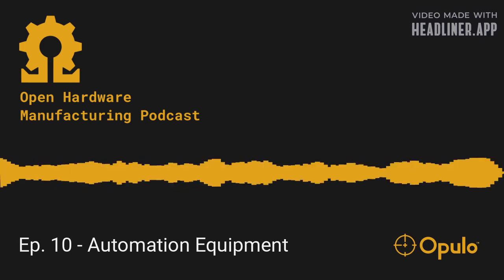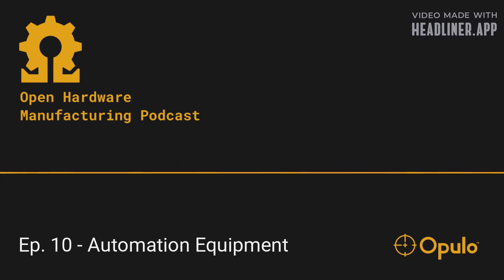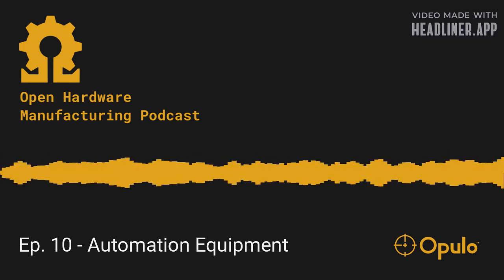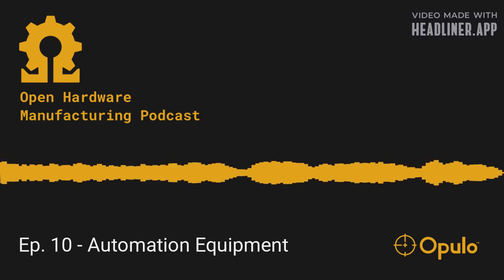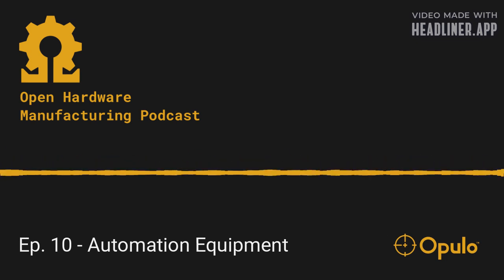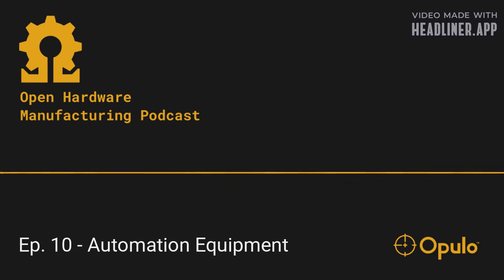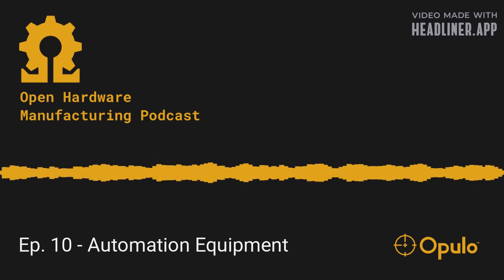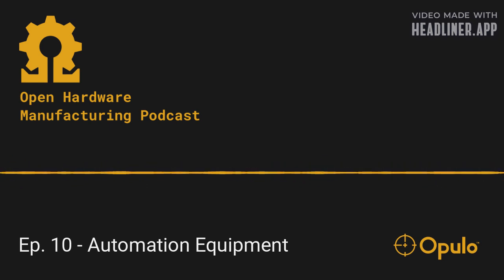Another example, kind of ironically, is the Lumen. This is the epitome of a project because this is the whole point of the company. The pick and place that we make and sell, we use so we don't have to manually assemble all of our circuit boards. It is a tool that we use to build everything we make. Project for us, tool for hopefully everyone listening. We chose that to be the thing we take from project to tool as an organization. That's a ton of fiddly component work that if we can automate to a computer that goes, 'I know what a properly aligned TQFP-100 looks like, this is where I place it' — awesome. A pick and place removes over 500 decisions for you.